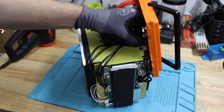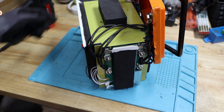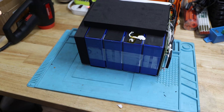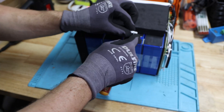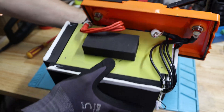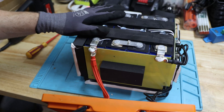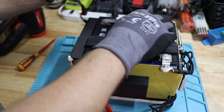We have a temperature probe or sensor somewhere — I spotted it already. It's down here. Let's see what it is. They did claim it has high temp cutoff, and it does look like a temperature switch with '65' on top — so this is a 65°C temperature cutoff switch. And we have confirmation that those are prismatic cells, as described. It's nice to be able to see that and confirm it.